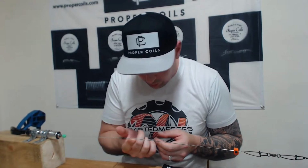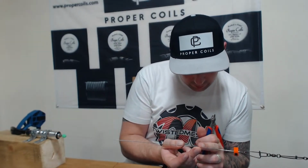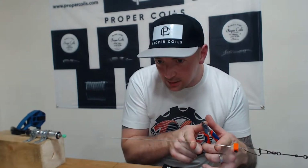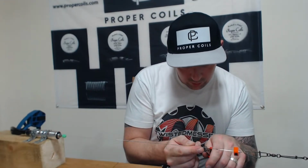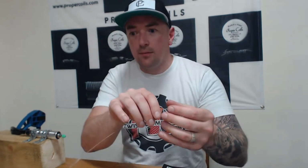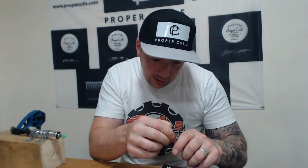Right, so we're all good here. I see a spot. There's one spot here, a couple of inches from the end. So from here to here is no good. The last 2 inches, so I'm going to cut that out of it. Right, so all of that is good wire. That's about 12 inches, maybe about a foot. So I'll definitely get 2 series coils out of that.